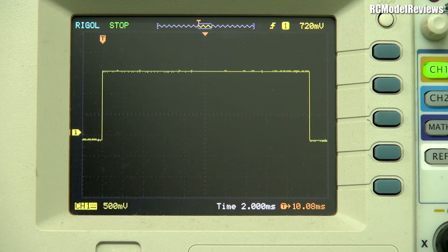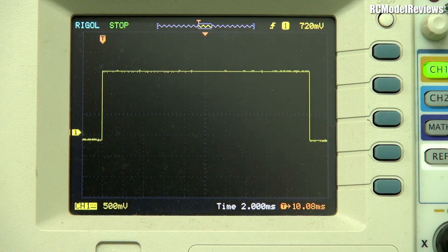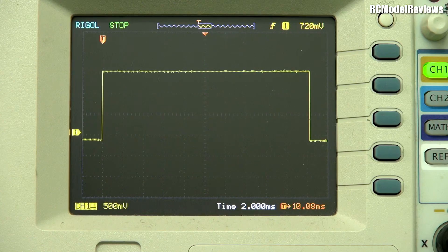If we'd put our light bulb here, that current would have just flowed forever until we unplugged it manually. This is a smart piece of kit - once it realizes something's wrong, it instantly disconnects. When I say instantly, it takes 1/50th of a second, which is faster than you or I. If we were using a light bulb, I would expect 100 to 200 milliseconds before the light bulb even started to glow, because filaments have thermal inertia - they have to heat up. By the time your light bulb is glowing, your valuable electronics have already become toast.